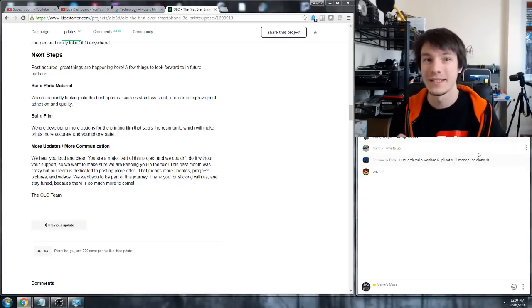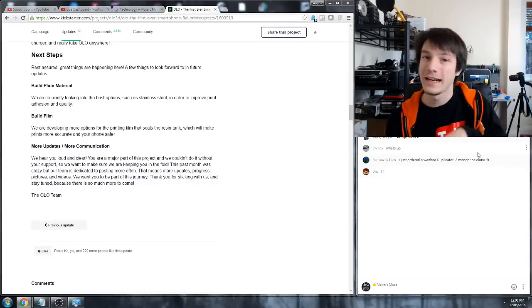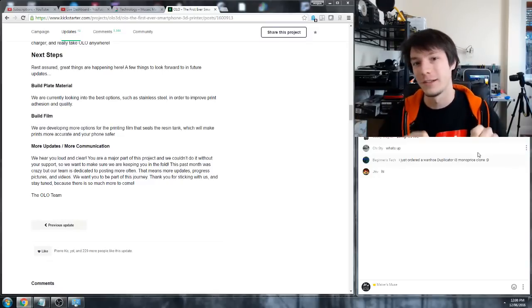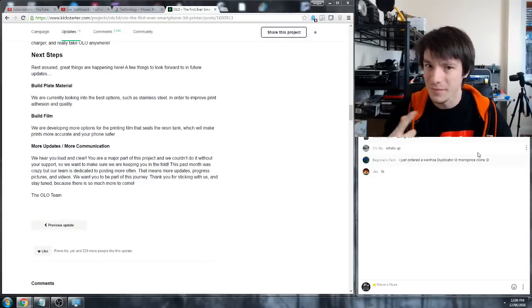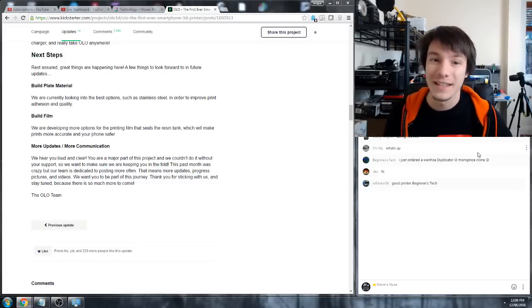The biggest issue is when joining two filaments together they need to be precisely 1.75mm or 2.85mm diameter, otherwise your filament extruder will jam up. When you're melting things together, keeping that consistent is difficult. You either need a form to constrain the diameter as it's cooling, or you shave off the excess blob when you push two melted ends together.